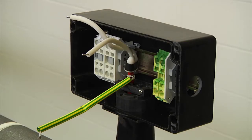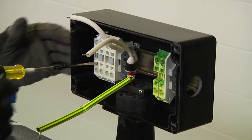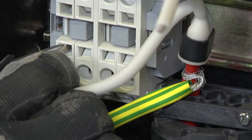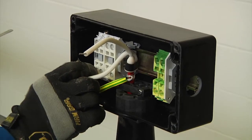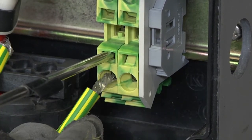To connect the bus wires and braids to the terminal blocks firmly, insert a flat blade screwdriver into the square hole to open the spring. The screwdriver will lock into place, allowing you to move your hand and insert the wire into the round hole. Remove the screwdriver to clamp the wire, and use the same procedure to install the power wires into the terminal blocks.